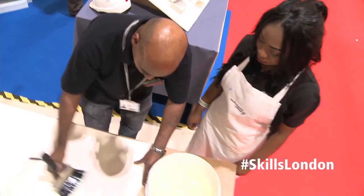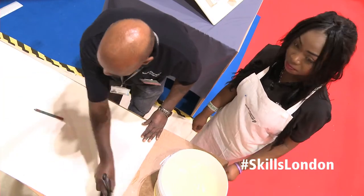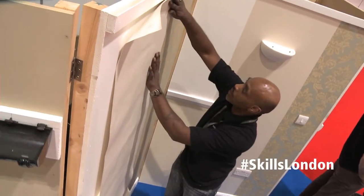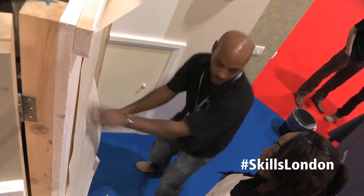The paste — middle out. Making sure all the edges are touched. Put the paper up. Simple. Now I want you to match against this edge as straight as you can. Keep matching against this edge like this.